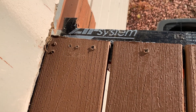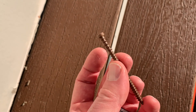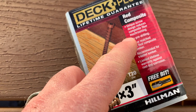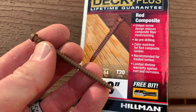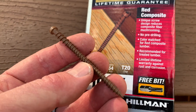It really was discouraging. After some research, we figured out that these are going to be the best screws to use. Let me show you a couple of key features. It's a unique screw — it reduces that fiber mushrooming that I showed you on the other part of the deck. There's no pre-drilling needed, which is huge. These just self-tap and are able to go in fairly easily. You do need to use an impact driver — I highly recommend it.